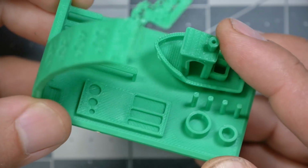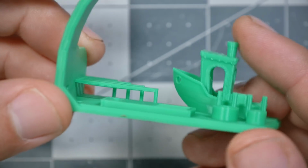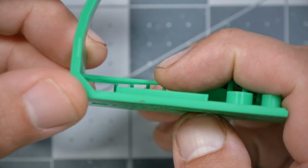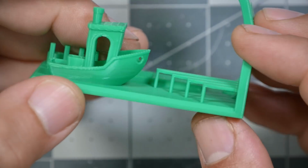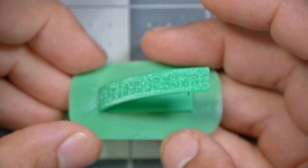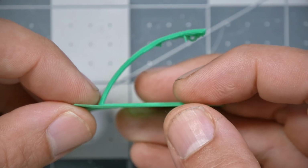You wouldn't expect a lot of stringing with PLA, but suffice to say, the Benchy looks really good and clean, and the bridging test, on all except for the very longest bridge, there's almost no sagging. You can see just the tiniest bit of sagging on the very longest bridge, but overall, it looks really freaking good. And the overhang, well, hang on. I printed a separate dedicated overhang test, and it got all the way out to 90 degrees without the print failing.